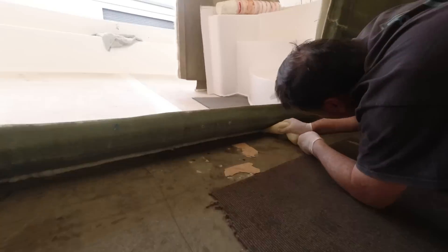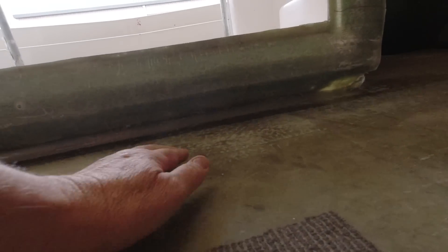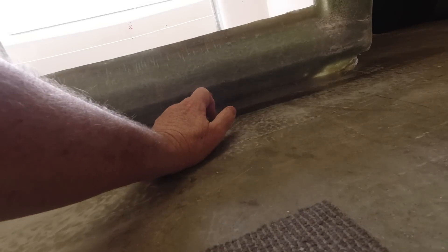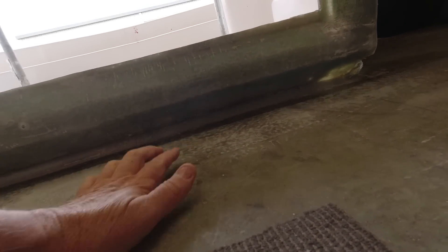I've literally spent days tabbing the rear cockpit and around the stairs, basically down to the hull. The deck is glued down with tons of epoxy. I then have to put a fillet of cotton flock and vinyl ester in at the door here. You can see the white epoxy along here — it's around about a half centimeter thick — and then filleted. What I'm actually doing is putting in a vinyl ester fillet on top of that which bonds the hull and the deck together, and then tabbing from here to here to join the hull and the deck.